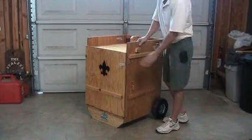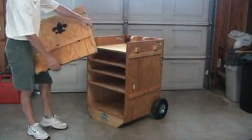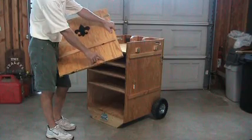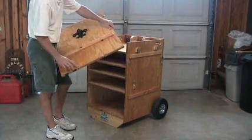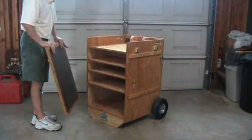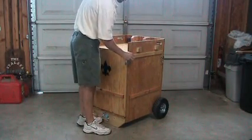Once undone, you're free to go. The original had four latches on each door; this only has two, because I've also changed the bottom portion of the security to a pin system. I lift this up — you can see, and again there will be close-ups in pictures if you request the plans — that in the bottom there's a shelf pin. These are pins you can buy individually, basically just for removable shelves you'd have in your home. I drilled a hole through it, fastened it with nut and bolt hardware, and cut off the sharp edges. At the bottom of the box itself, I've seated a couple of T-nuts, drilled and glued in so they don't come back out, and lined them up. When it's ready to go, you seat the pins in the T-nuts, lock the door roughly in place, secure your safety latch, take your lynch pin, clip it in, and away you go.